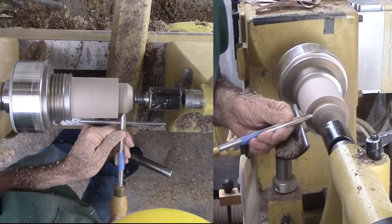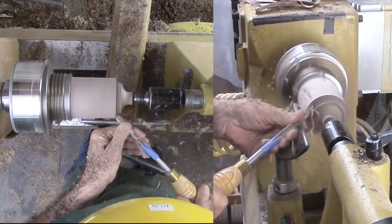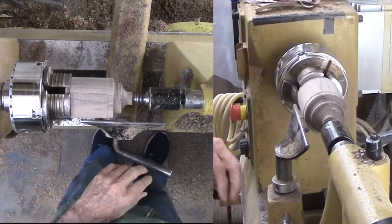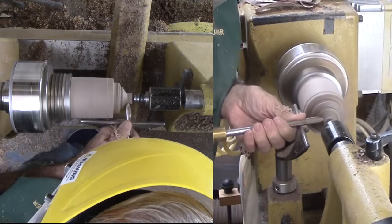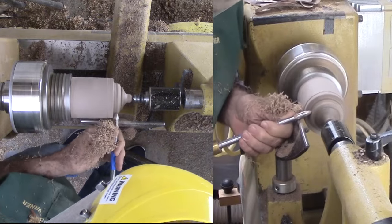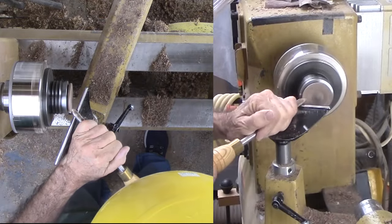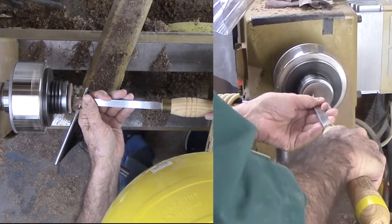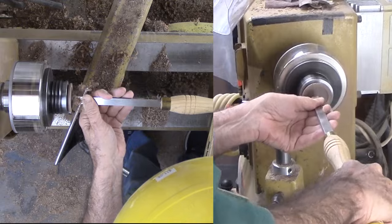Now for the base. The other part of the original wood cylinder is mounted to the chuck. I will not need all that wood — I'll save some for a later project. It does not take much to shape and drill the base since there is no distraction as in a one-piece goblet of the bowl and stem. Sand and finish here also while on the lathe — there is no better way to sand and finish a lathe project. However, I incorporate a small ledge to serve as a tenon for a future mount. Now the base is mounted with that ledge tenon. Since the size matches closely to the jaw capacity, there is little risk of damage. After cleaning off the bottom with a spindle gouge, I cut a small recess with a box scraper. Then sand and finish. I can do a much better job on the bottom of the base than when I turn a single-piece goblet.